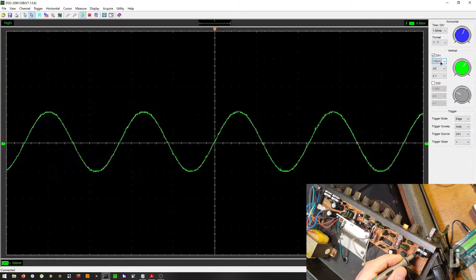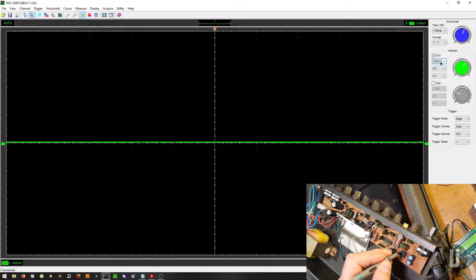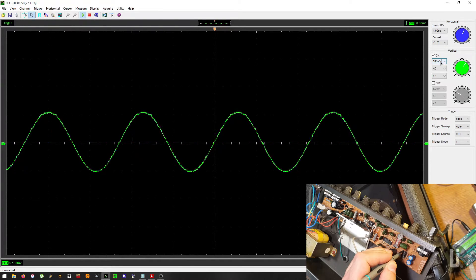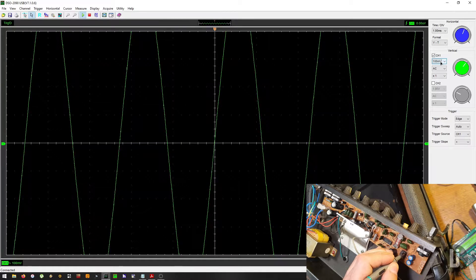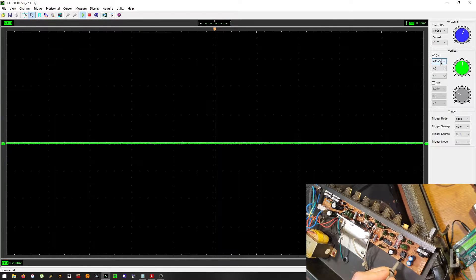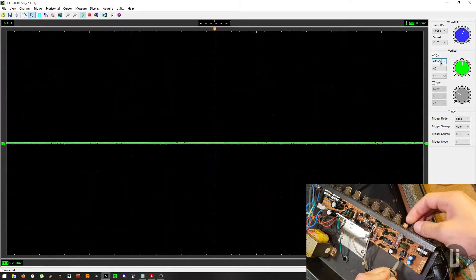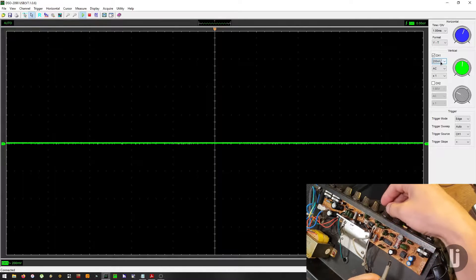We have a test signal: a 440 Hz sine wave, about 0.2 volts peak-to-peak. Let me first quickly go through the clean channel. On the input of the first op-amp we have that exact same signal — the sine wave — and on the output, as expected, a larger signal. If I zoom out you can see it's a perfectly clean sine wave. On the output of the second side of the op-amp, with the volume turned up, a much, much larger sine wave. Boring. Let's go straight into the 'I want to be a Marshall' channel — this is what interests us.